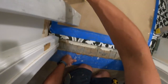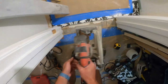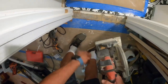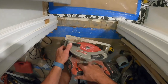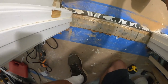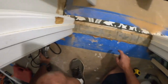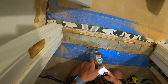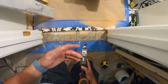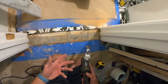Next step, I get my vibrating saw. To be more efficient, I use my circular saw set to three-quarters of an inch depth and rip as much as I can. The remaining two or three pieces I'll clean up with the vibrating saw. Now, if you're cutting through oak, it's kind of hard and it's rough on the vibrating saw, so take your time with it and be patient.